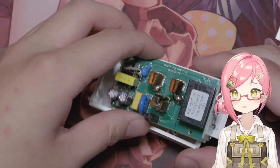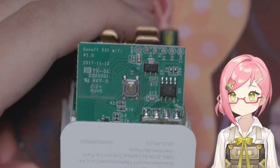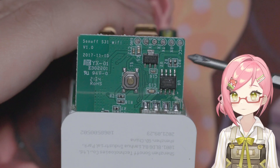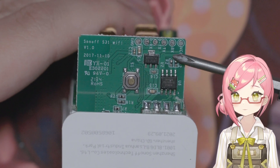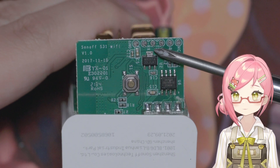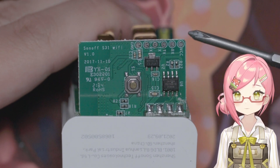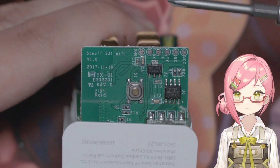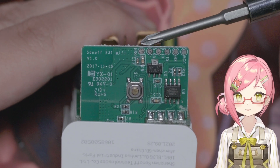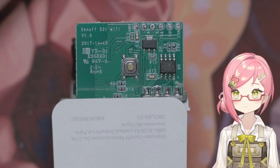After the unit is open, you can see that the whole unit is extremely simple and rather tinker friendly. The main board we want to focus on is the one on the right. I've clearly marked out VCC, RX, TX, and ground pins. You may notice there are two sets of TX and RX — ignore the ones next to the ground pin. I'm not entirely sure what they're for, but they might be related to debugging since there's a D prefix there. You're not supposed to flash the firmware through those.